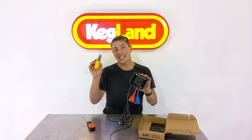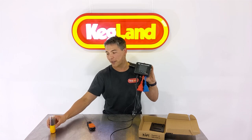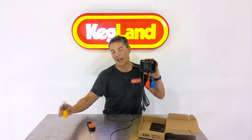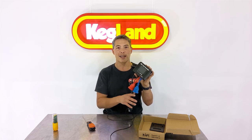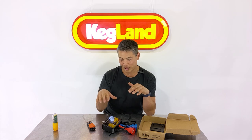You can make the hydrometer even more battery-efficient by turning the Wi-Fi off and using the low-energy Bluetooth beaconing function — that firmware is just getting released. Instead of connecting to the internet directly, the hydrometer uses a really conservative battery consumption by broadcasting a Bluetooth beacon signal. This temperature control box receives that Bluetooth beacon, packages up that data and sends it off to the internet. Since this controller is plugged into mains power, we're not concerned about its energy consumption. They all work together — that's one of the nice things about the whole RAPT platform.